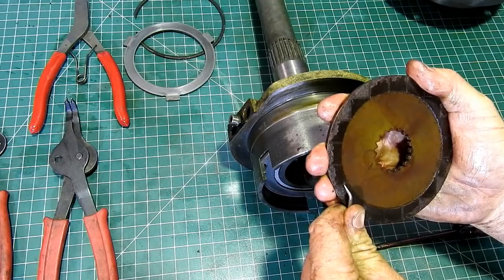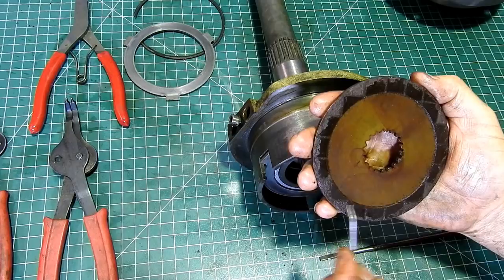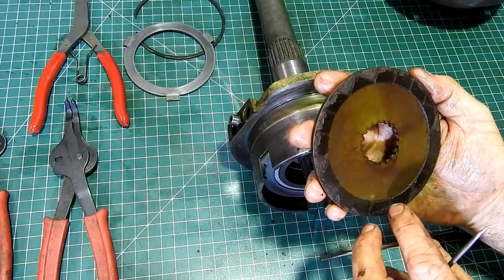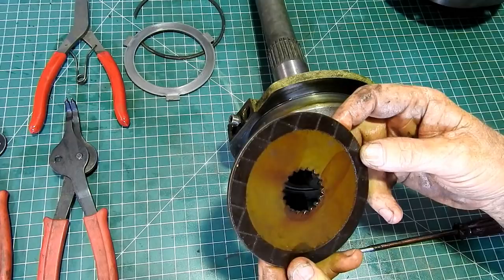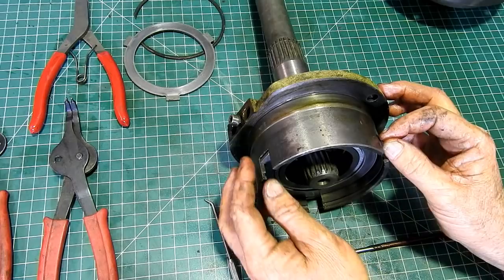Now if you pulled your screen out and you had all these little bits of dark lining, or sometimes it'll actually come off in sheets — there would be a sheet with a corner on it, and those parts will still be together in your suction screen or down near your suction screen. That would give you an indication that it's this. Sometimes brake plates can be the same but over time you sort of get to know. Anyway, that's buggered — in the bin.